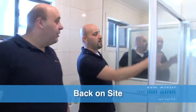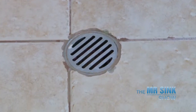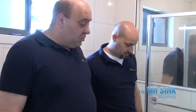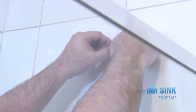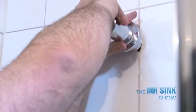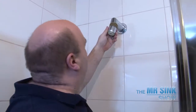I've finished this job — even the squeak has come out of here. Look how clean it is — all the mould in the corner is all gone. The owners of the house will be pretty wrapped with this. They'll get at least another 10 years out of this and it's all clean and leak-proof now. Hey Rob, you forgot to fix the shower rose. No, I just gave it a good cleaning! Let's put this back and show the guys how easy this is to do. Although this is plumbing, this is not actually something that you need to be a licensed plumber to do. Put the Teflon on, and when you put Teflon on always go the same way you screw in — which is clockwise. Done.